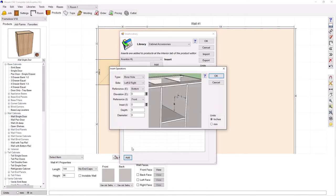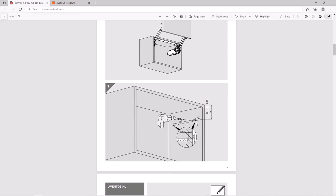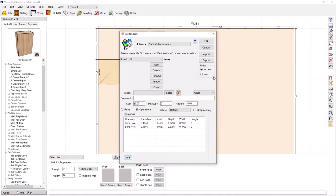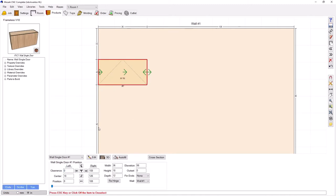We're going to go ahead and add another one for the back hole — left and right side, referencing the top, that same 88 millimeters down. From the front of the cabinet for this one, it's 192 plus 37, so 229. Again, we need a five millimeter hole and a depth of seven millimeters. Press OK. That's a very basic insert, but a really good first insert if you're just getting into them. Let's press OK and put that in the cabinet to get our mechanism placed.